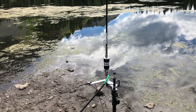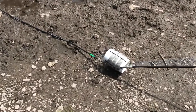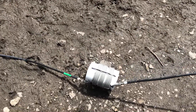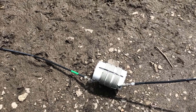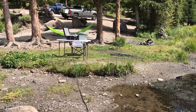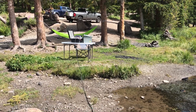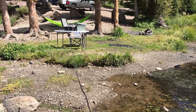Less than ideal band conditions today as well, but lessons learned. Here's a homemade choke which I made — improvised very quickly — which I'll go back later and redo. More coax lessons learned: I should have brought a 50-foot piece. Instead of LMR 400, it should be something a little smaller because it's HF, but it's what I had on hand quickly, and so it's what I took.